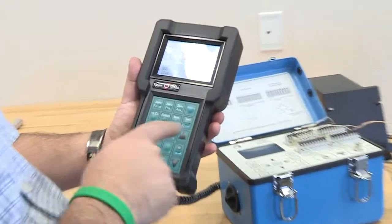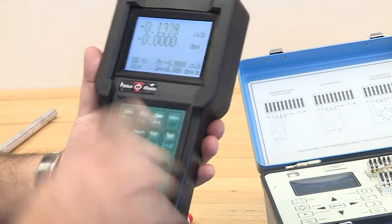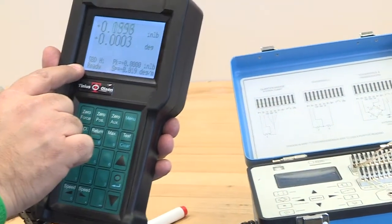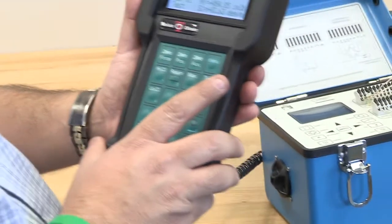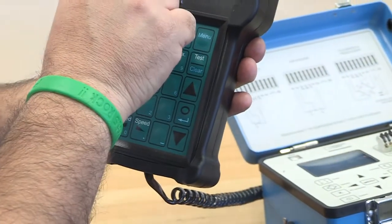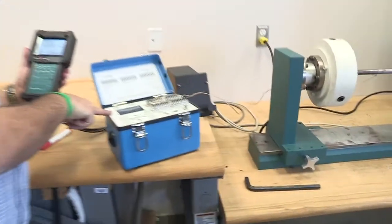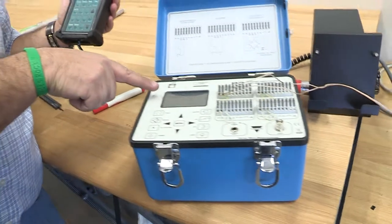This is high clutch and low clutch — you can do either. I'm going to do high clutch, and once you select it, it says 'high.' Then click Test — it says 'ready.' Now it's your choice whether to go forward or backward, clockwise or counterclockwise. I'm going to go forward. The machine starts spinning and the strain starts to increase. At 10 degrees I'm going to stop using the circle button — you click that and it stops. At 10 degrees, the torque is 2092 inch-pound. That's my first reading. Then I read the strain, which is 1063 times 10 to the minus 6. You multiply that times 2 to get the shear strain.